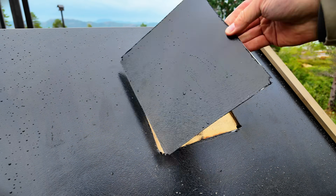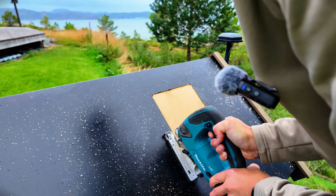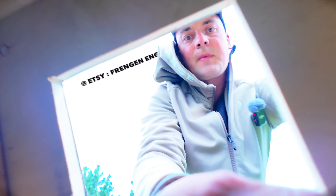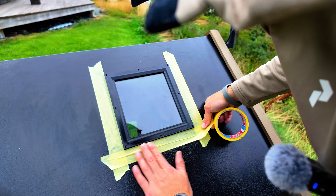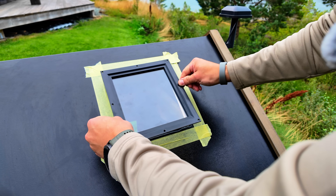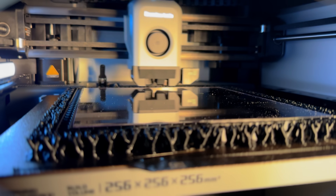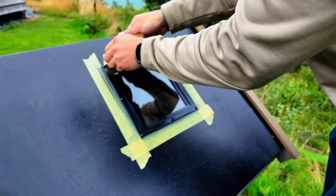I was asked a lot to upload a build guide for this project - with drawings, code, 3D prints and everything - so I had to make sure it's a solid setup. The build guide is available on Etsy now, link is below. The window I made the same way as the little lid for the box in the last video. I designed the window's frame with a three millimeter gap, then added a pause in the printing process at a specific layer so I could insert the glass and then start the print again.